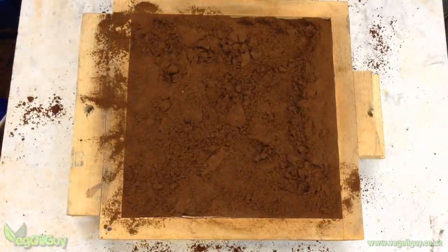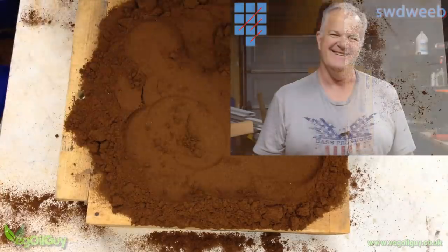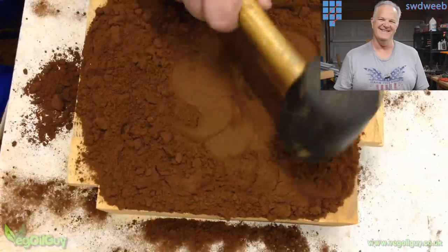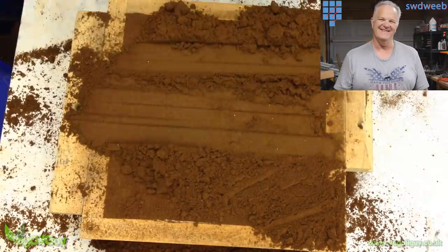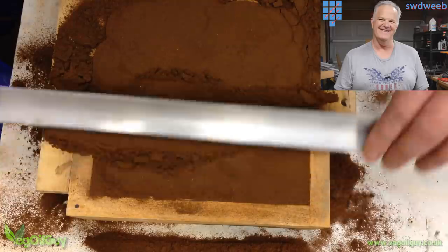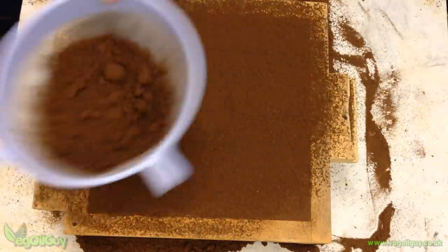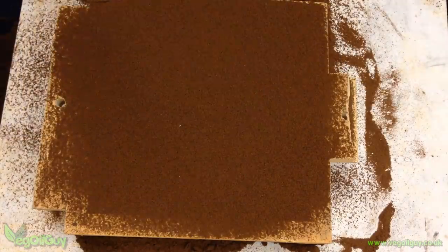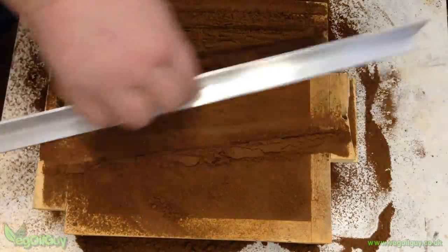Whilst I'm talking about proper green sand casting, as well as our resident guru Martin, I'd also recommend looking at SW Dweeb's YouTube channel. Just like me, Dweeb doesn't claim to be a professional, but he's pulling out all the stops to develop his casting skills and he's doing a great job of it, so he's an excellent source of education, inspiration and entertainment. When I think I've got everything packed down nicely, I sieve some sand on top to try and give myself a nice fine finish. Then it's just a matter of packing it down some more and striking it off until it's nice and flat.